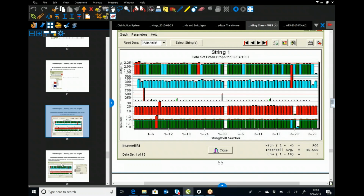So if you walk into a data center and you see a UPS, you'll see a string of typically 40 jars. They're 12-volt nominal jars. Their float voltage is usually between 540 and 545 volts per string. And a lot of the UPSs actually have the capability of operating with up to 6 strings. So you'll have 6 strings in parallel.